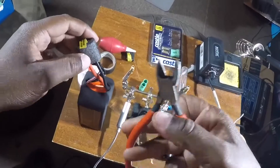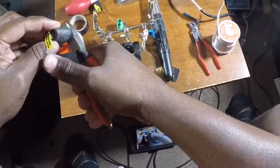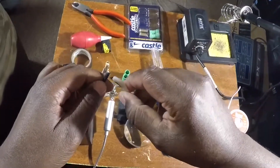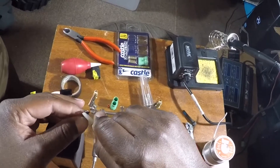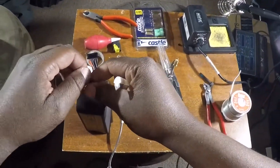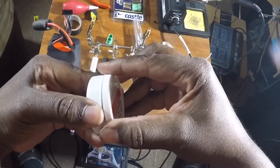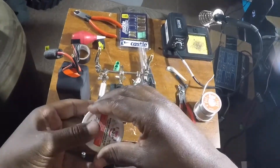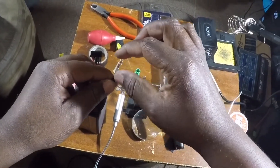Go ahead and cut this, then use your envelope opener or whatever you have to take off the plastic from your wires. I try to use something sharp enough to get the plastic but not sharp enough to cut the metal wire. Now I've got that stripped — I'm going to go ahead and put some flux on there. Don't need a whole lot, but get it up into the threads.